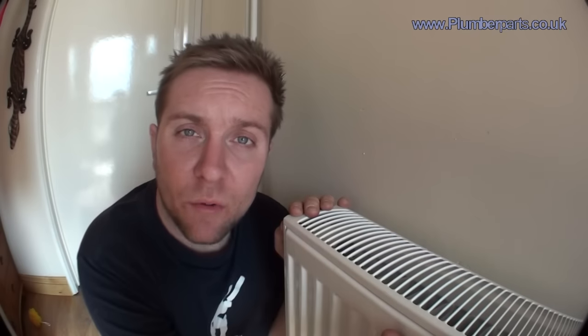However, that might not have solved your problem. You could still have air in the radiators. The symptoms of air in your radiators are quite simple to describe. If you already have a hot flowing return going to the radiator and you've felt down the radiator, it should be warm at the bottom and at the top it will be cold. This is always a sign of air being in the rads.